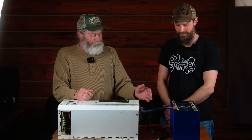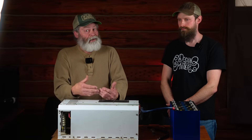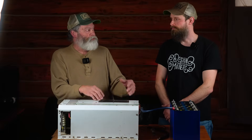All we're going to do is slow the flow of current from the battery to the inverter so the capacitors fill up slowly — and when I say slowly, only like 5, 10, 15, 20 seconds. It's not that long. But when it happens, it keeps the capacitors from blowing up.